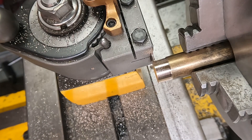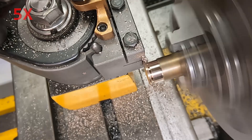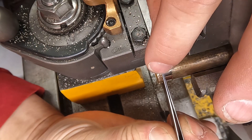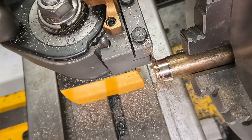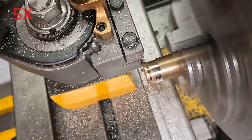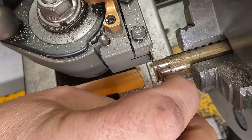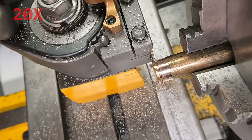I'm actually making the piston slightly thin because my barrel is slightly short because of the previous adventures with the barrel. It is about 15 thou undersize and there's very limited clearance for the piston in the barrel between the two ends with the crank throw, so I'm going to make the piston a little bit shorter. I'm using feeler gauges here to see how wide my groove is and it seems to be about 43 thou, so it needs to come out another 7 thou. I step it down 7 thou and go in for another cut, but when I measure it it's not 50 thou — I think this tool is not liking making a very narrow cut at the side of a groove; it's deflecting slightly. No matter, I just make multiple passes moving it down a couple of thou and repeat with the other groove.